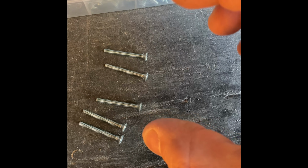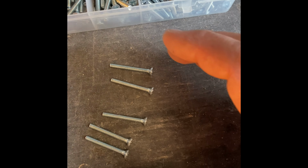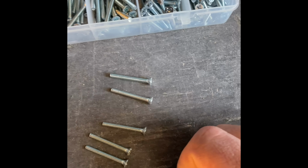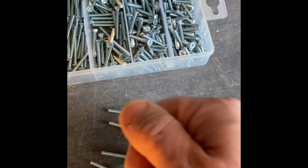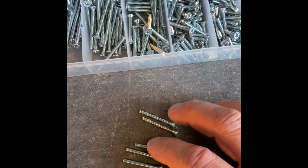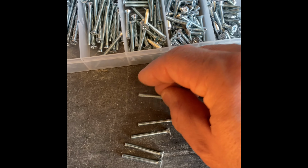And so you kind of have to play with it to figure out what is your happy medium between it being nice and snug or being too loose. Because when you go to put the plug in the wall, you really don't want the outlet to move around, and you don't want to take a chance at cracking the plate either. So you kind of have to play with how far you back these out a little bit and find a good middle spot.